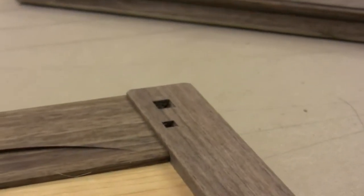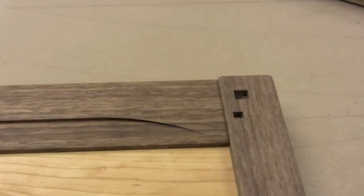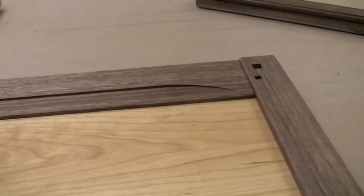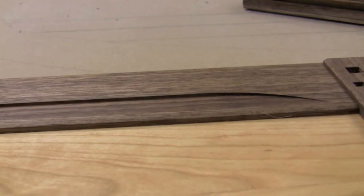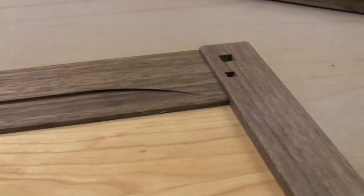You can also make out the holes for the pegs. Here at the top I have two holes of two different size pegs, and then you can make out this curved indent along the top rail which goes all the way along from side to side. It's a slanted indent about a sixteenth of an inch at the top, then comes all the way up and is flat at the top, so that curve just fades away in the corner.